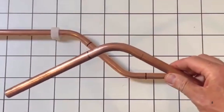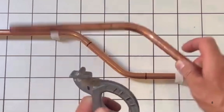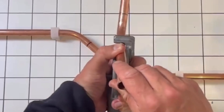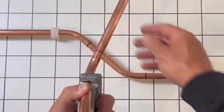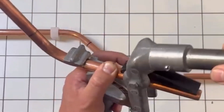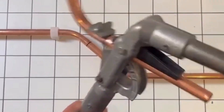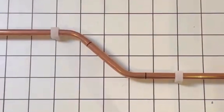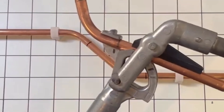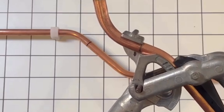The second and third bends are going to be pulled at 30 degrees on those marks. Flip it over and put it back in your bender — make sure she's straight. You don't want it ending up like that; it wants to be straight centre with the line on the bender. Bank it back in there and pull that at 30 degrees. There you go.